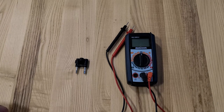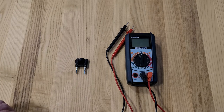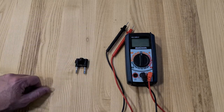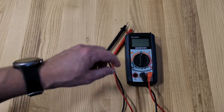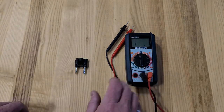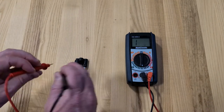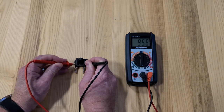Before you can start taking voltage readings you need to measure the resistance across our voltage resistor. The lab says it's 100 ohms, which it is, but not every resistor is exactly the same so we need a more exact measurement. With your multimeter, make sure you turn it to the smallest scale on resistance since we're dealing with up to 100 ohms, and try to get your best reading across the resistor — hold it for a number of seconds until things stabilize.